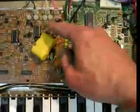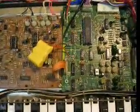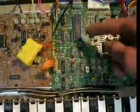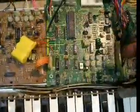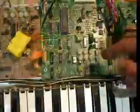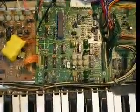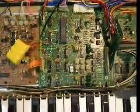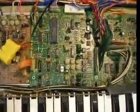You can see a battery that I've replaced here — I'm going to glue that to something when I'm done. The original battery sits in here and it tends to rust and destroy all kinds of stuff. These chips almost always get fried, and sometimes the CPU socket gets ruined. This connector back here can get ruined, traces get melted off the board. It's a lot of work to restore this board, and you can't replace any of it unless you can find another good one. A lot of these have gotten wrecked, so give them to a certified technician.